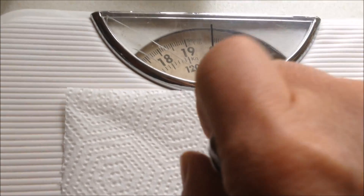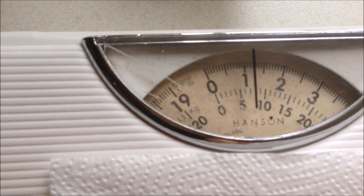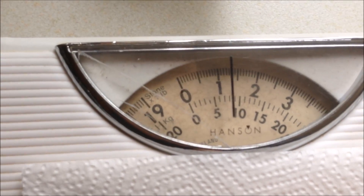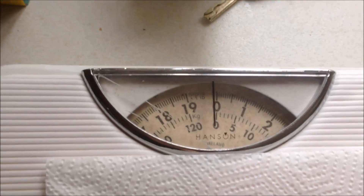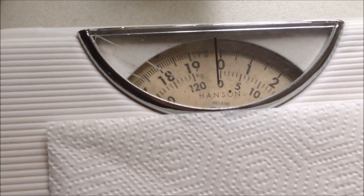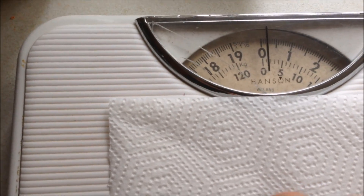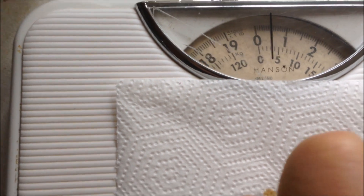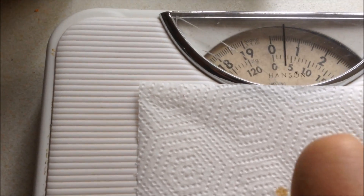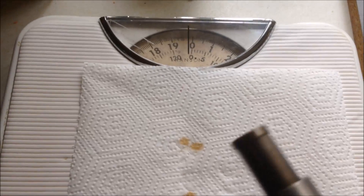We press to the bottom and release a little bit — that's about 8 kilos. Doing it again: press to the bottom and release a little bit — it's about 8 kilos. That is the new design spring strength. Now for the old one: press it to the bottom and release a bit — about 5 kilos. Do it again: press to the bottom and release a bit — about 5 kilos. So the difference in spring strength is 8 kilos for the new design versus 5 kilos for the old design.